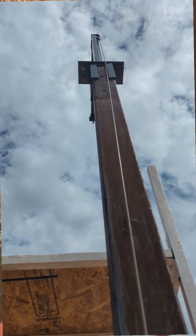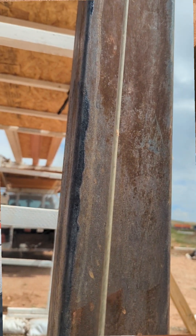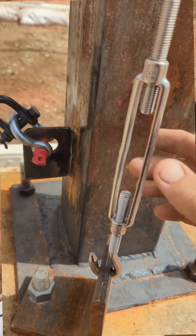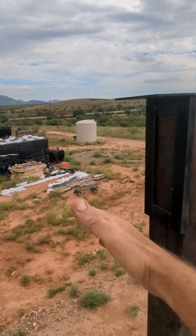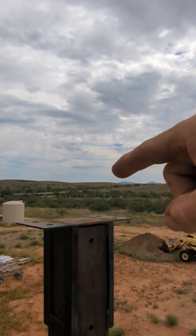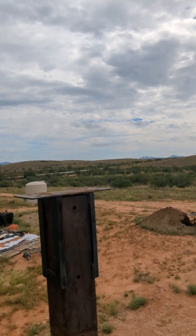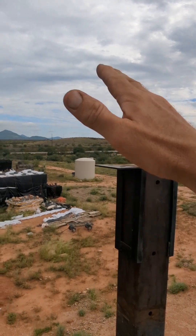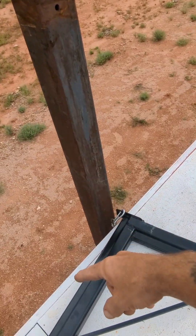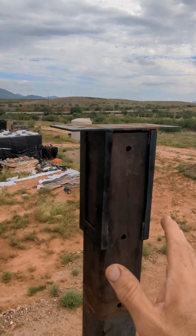I have a line with a turnbuckle — how I tension it is this line goes straight down to a turnbuckle and I tighten it. There's a tension line on the back of this that keeps it in place. When the hoist is pulling up on a piece of steel, even though there's a sleeve here, it would have a tendency to move forward, but that line keeps it from doing that. So that's what this line is — it's actually a pretty important part of this.